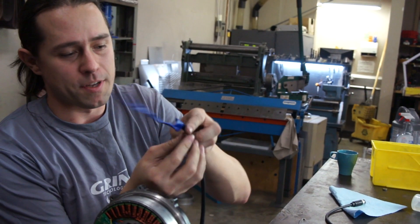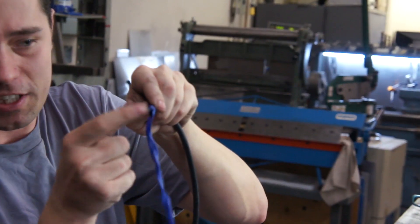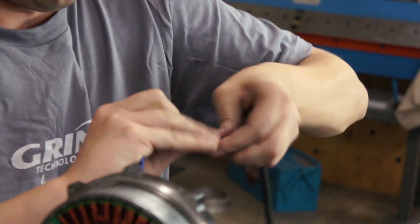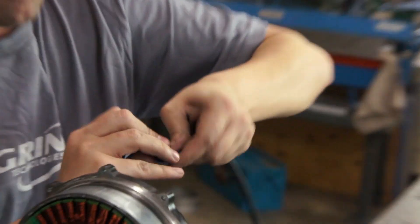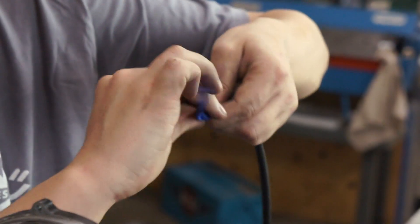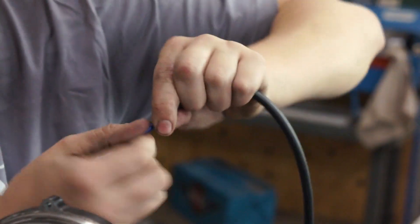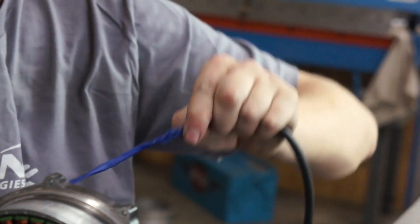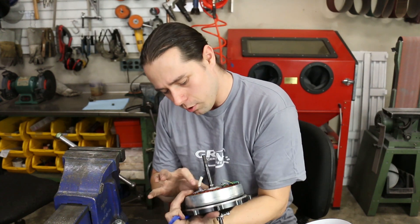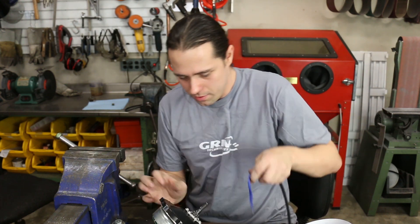Here's a good example of something to correct before the pulling operation: the part of the tape I've formed the string from is not concentric with the cable — that simply won't do. The most critical part of the wrap is that point where the inner sheath ends and you go from sheath to a straight run of fish tape. We're going to be feeding the tape in through the axle bore and looking to pull it out through the small escape bore on the other side — which will probably require needle-nose pliers.